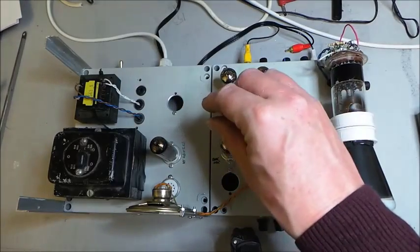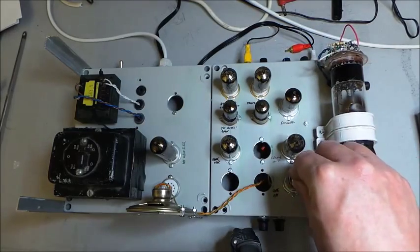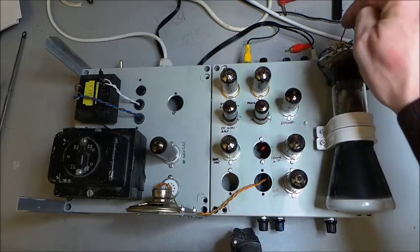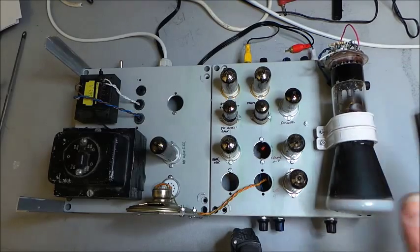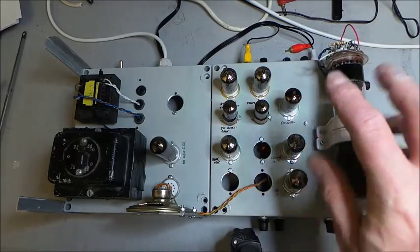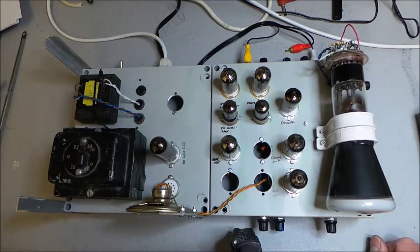Again, the waveform comes out of there, feeds our differential amplifier, feeds our X plates to give us the line deflection. Now the plates are referenced to our 700 volts anode voltage. So the plates are actually up at 700 volts. There's some hefty coupling capacitors from the output of these two small amplifiers to the tube itself. And there it is. Marvellous. Let's switch it on, warm some valves up and watch some telly, shall we?